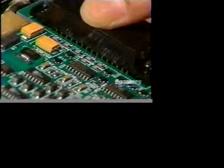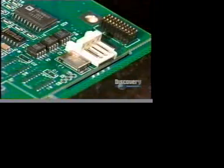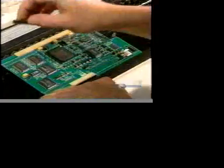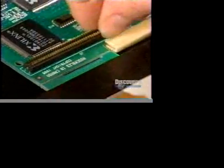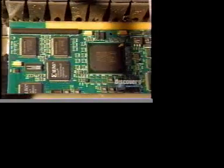Different circuit connectors through the card are inserted into their respective holes. This operation requires great dexterity and is entirely done by hand. The metallic placement points need to be soldered to the card. The soldering of the circuit components through the card is done with a bath of molten tin lead alloy at a temperature of 465 degrees.